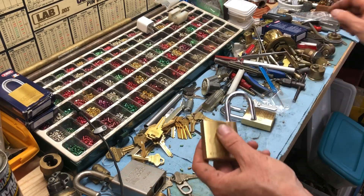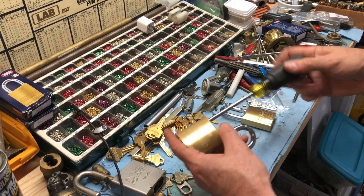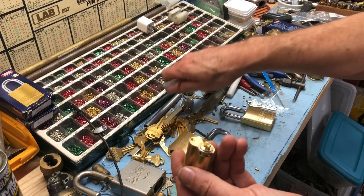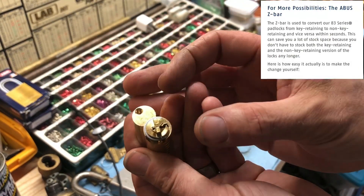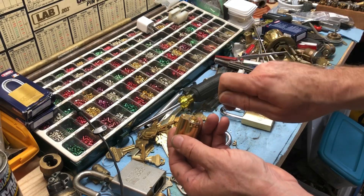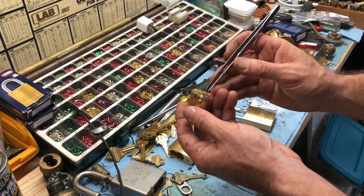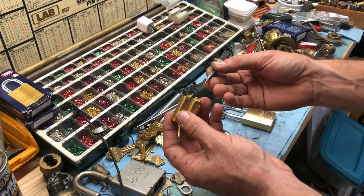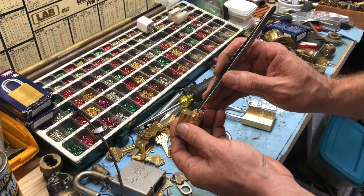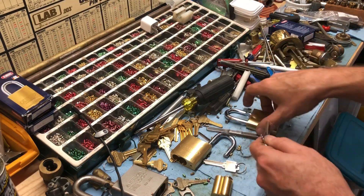I do want to show you one little trick to it. Let's grab a screwdriver, take them both apart - the trick is in the keying of it. Now of course there is this little thing called the doodad. This doodad is used for key retaining, which means when you open the padlock the key won't turn to remove it until you re-lock the padlock. That limits the chance that the padlock would disappear. If you want to use it without the key retaining feature, just take this off and don't use it at all. If you do use it, when you're looking at the back of the core, you want that dot to be facing up.